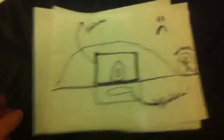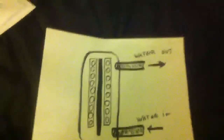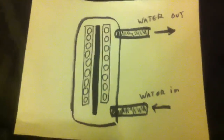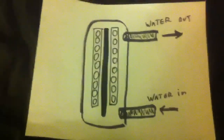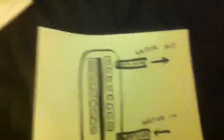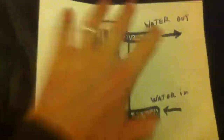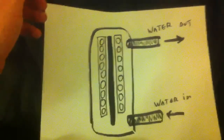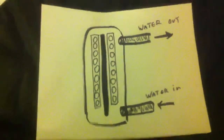People keep saying, why do we pump water on this stupid thing? What possible good is that going to do? Well, the reason is these decay products are reducing — they decay exponentially with respect to time. When you cut one of these things off normally they're really, really dangerous and highly radioactive. You pump water through a perfectly working one for weeks, months even, before it's ready to have the top popped off and the fuel rods taken out. Fukushima Daiichi reactors 5 and 6 are in this current state — they're intact and cooling, and they will remain that way for weeks, maybe months. Then they'll eventually open the top and pull the rods out. If they haven't entombed reactors 1 through 4, they can cut off the damaged parts and remove the rods and then slowly remove the reactor pieces like they did at Three Mile Island and eventually clean the place up.